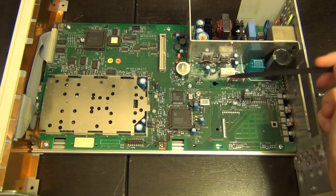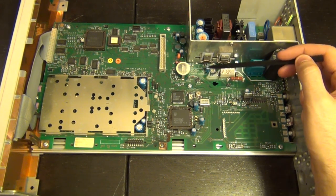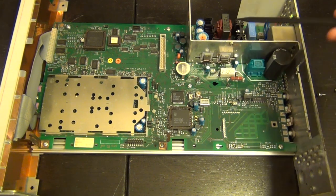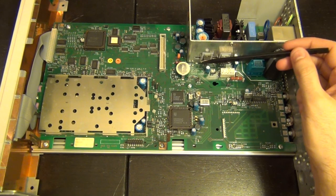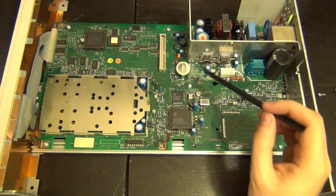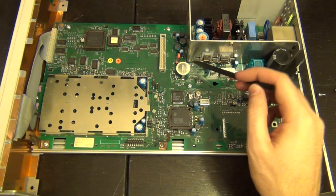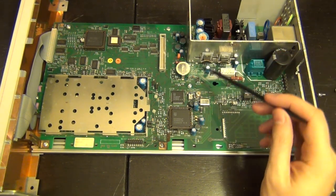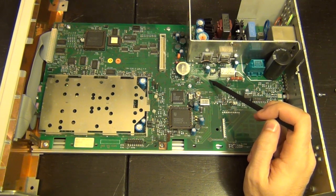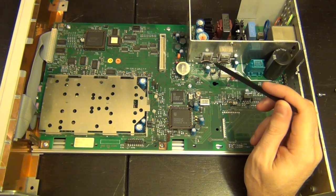And look at that, this actually has fairly well silkscreened comments on it. "5-volt adjustment on power module. Remove cover." Okay, so that is a potentiometer, and that must be the 5-volt regulator potentiometer. And there are two ICs that are not labeled. But aha, there are some pads in here, which I will focus on, that actually have some voltages written on them. And there's a jumper called jumper 16, load connection, disconnect. Interesting.